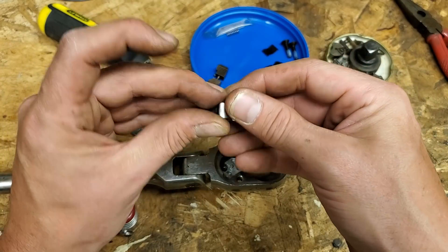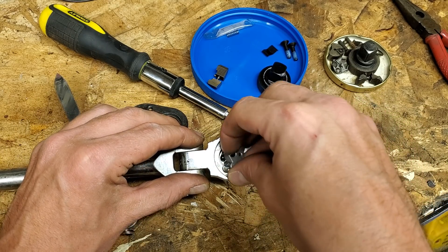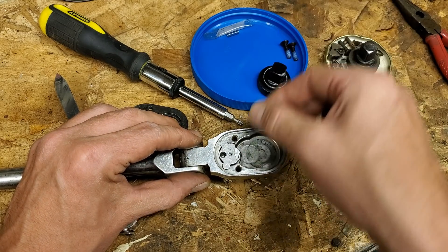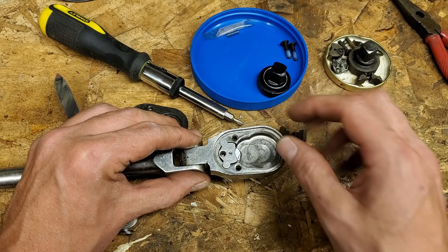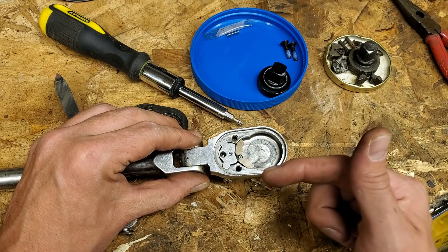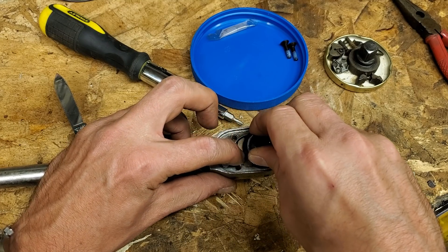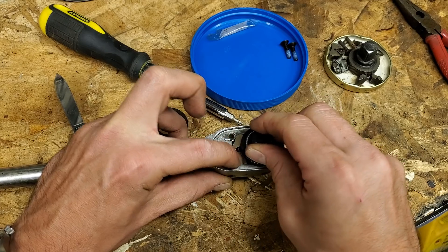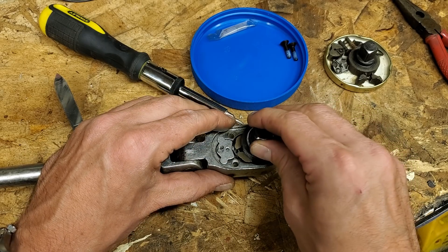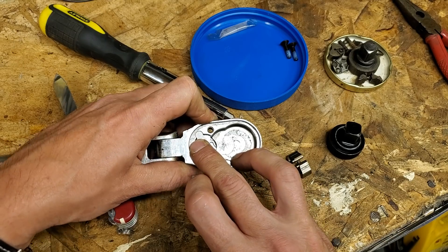This guy goes like that, and that pin right there goes in that hole. You can see — does it go like that? No, it goes like that. And the ball — you can see the ball sitting down there in that little hole. Now this is the part I'm not 100% sure about. This thing goes in right there, and I think that's what was screwed up because that pushes the pawl into the teeth so you get that good first tooth engagement. Now I don't know which way the pawl goes, so I'm probably going to screw this up. This spring goes in here to put tension on the ball. Yeah, this is the part I'm not sure about. I'm going to look like a freaking idiot doing this. I pray to God — once this goes in, I hope I get it first try. I just don't know which way because — god damn it. All right. We've got positive snap action. That feels good now.